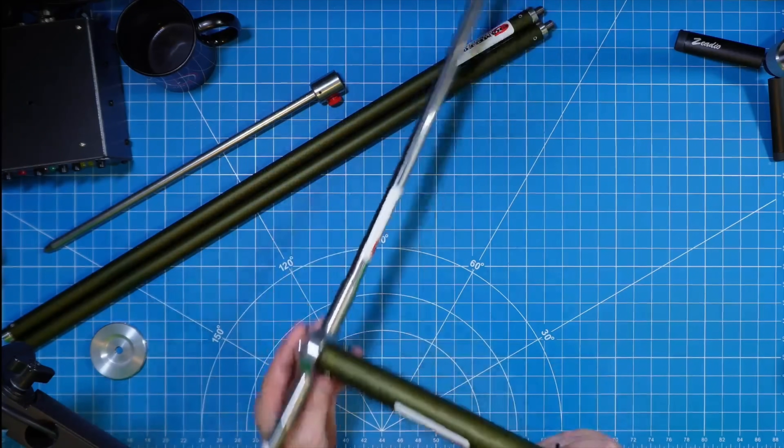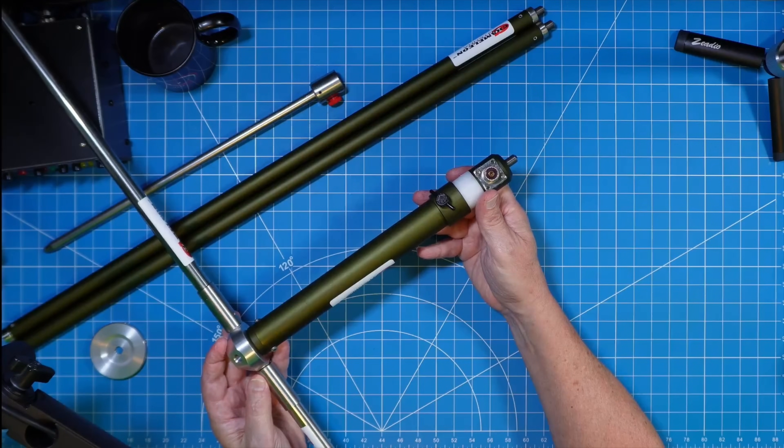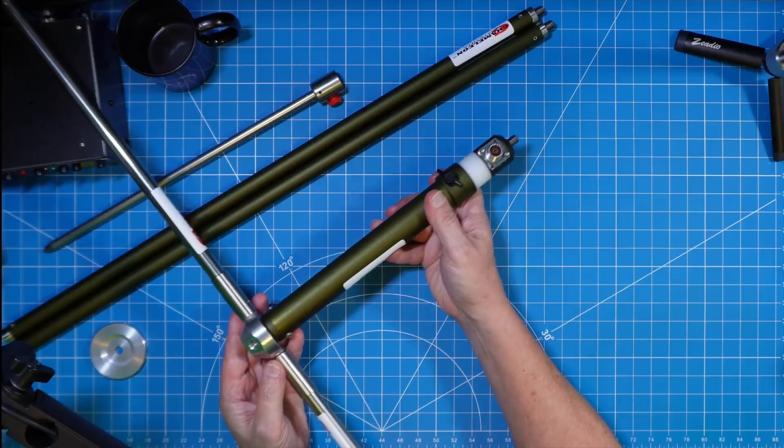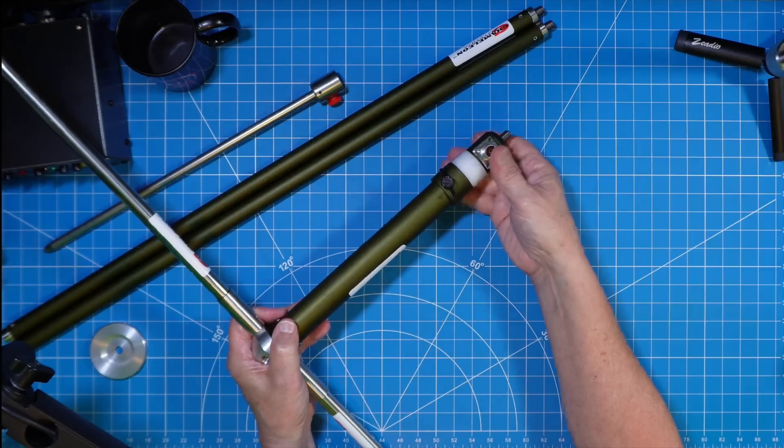When I deploy this, I'm six feet off the ground — a six feet high and 10 feet wide antenna. We're going to call this the T antenna, the coil-tuned T antenna. Once I deploy these at full length, I'm tuning using my coil.